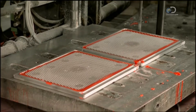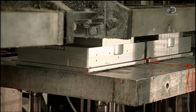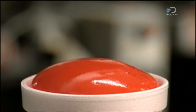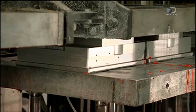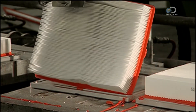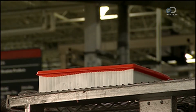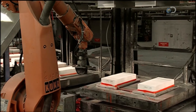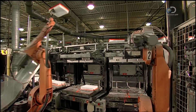An air cylinder pushes the plate holding the bottom moulds up to meet the top ones. The polyurethane swells and covers the screen and the paper pack, forming a solid, flexible plastic layer. A robot with grippers then peels the new air filter out of the mould and sets it on a cooling rack. Because of the wax sprayed onto the moulds, the filters pull out easily.